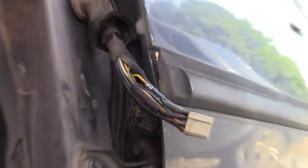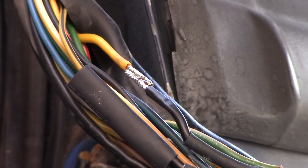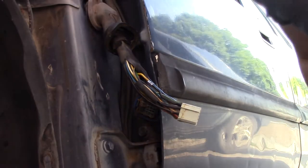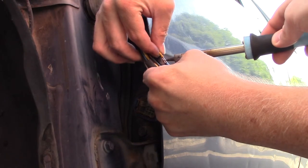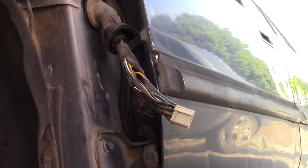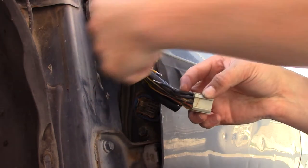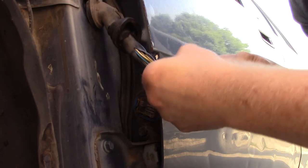Okay guys, looks like my battery died on me, but if you can see right here — well that one's doing perfect — right here I messed up. I forgot to put heat shrink on before I soldered the two pieces together, so now I've got to unsolder it, put the heat shrink on, and put it back together. Luckily it's not hard to desolder — it's better than a butt connector.